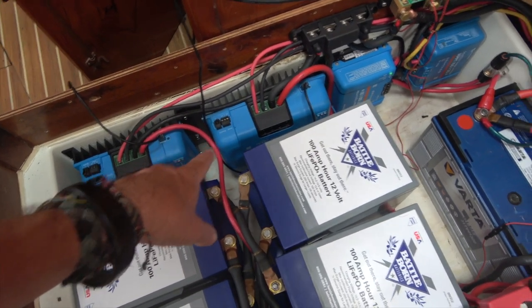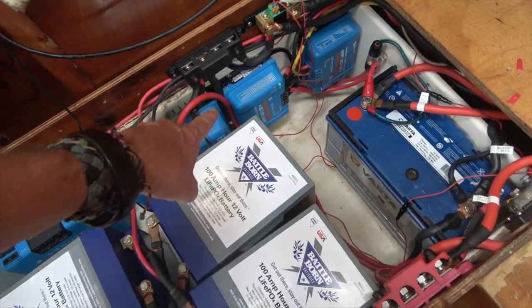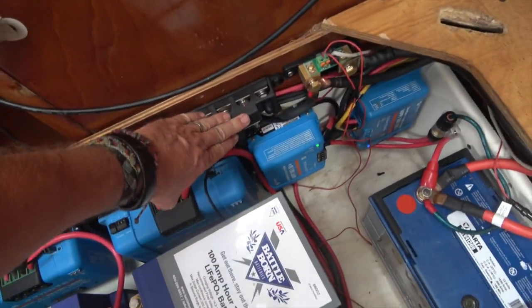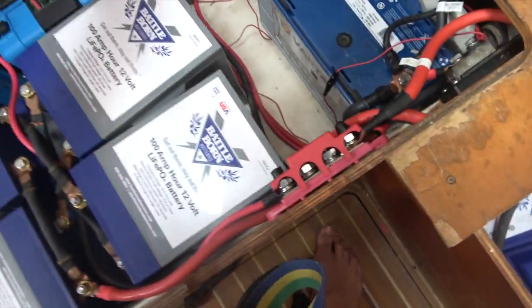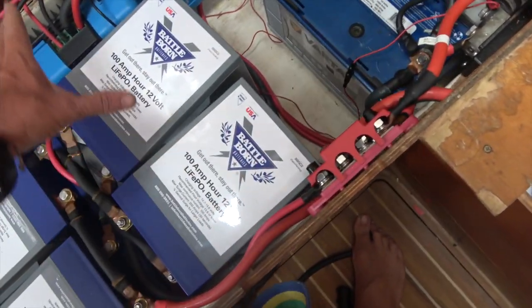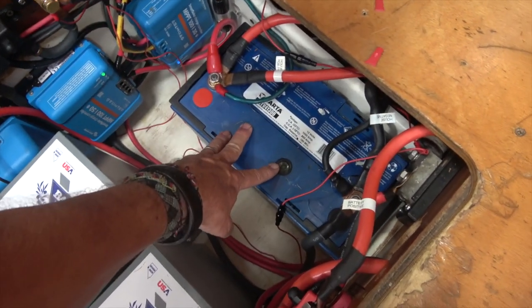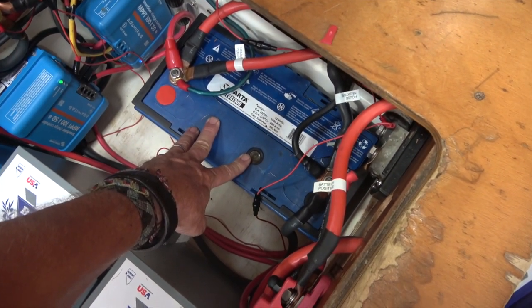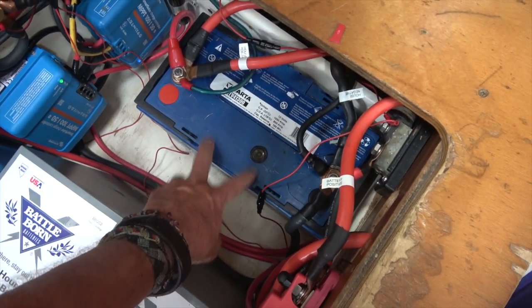the radar arch. The 50 amp, this is our house maintenance system, so it is feeding off of our 24 volt bank, which is negative supply there and positive supply here. So this is the 24 volt hookups, and that takes 24 volts through these wires around into our 12 volt battery that you saw us put in yesterday. So that is our 12 volt start battery that now runs the entire house.